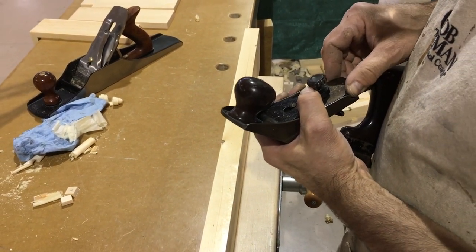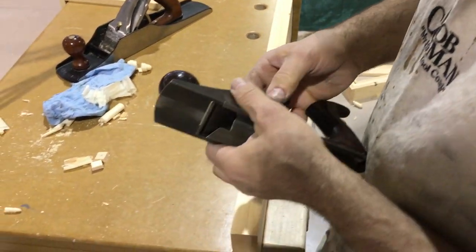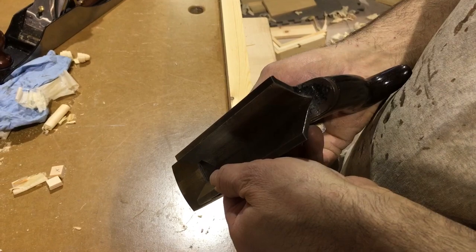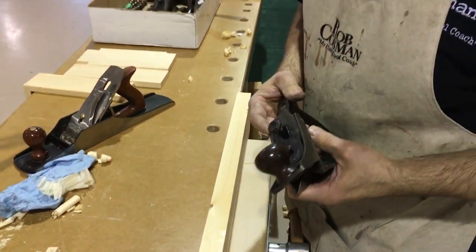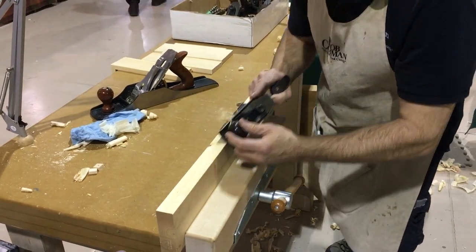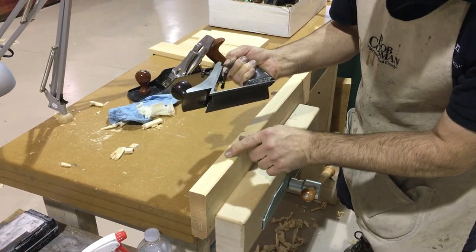I want to just make that a little more aggressive, so I'm going to bring the blade out. I'll adjust this for the amount of chamfer I want — make that so it's about a quarter of an inch. The chamfer will be about a quarter of an inch wide across the top. Now this is something you can easily do with a block plane, but you've got to get good at holding it exactly at 45 degrees. Sooner or later you'll stop cutting when this side references against that part of the board and that side references against that part of the board.